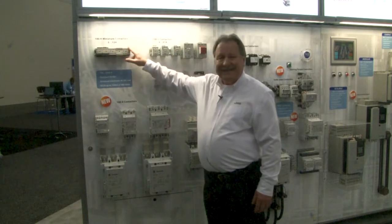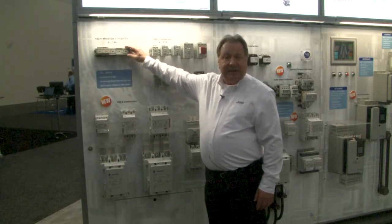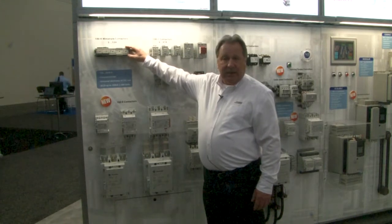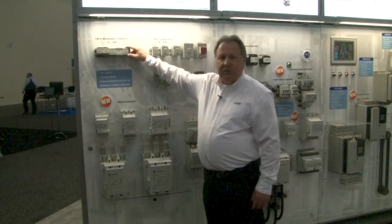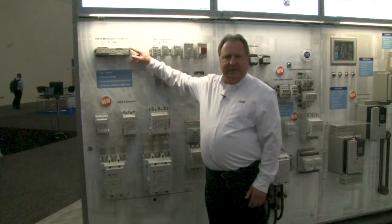We also offer them AC and DC in the same physical size. It's got one of the smallest contactor footprints out on the market and it's usually used for light duty applications like boat lifts and sump pumps, where they don't see a lot of operations.